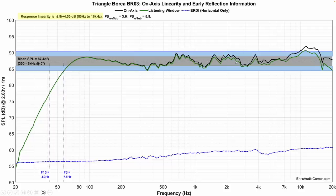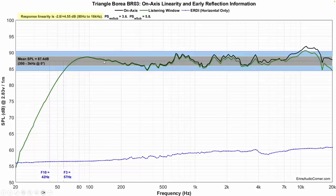Going higher in frequency, there's another dip at around 3 kilohertz, a strong spike at around 4 kilohertz, and then a rising on-axis response above about 7 kilohertz. This response, while mostly within a plus or minus 3 dB range, is pretty much all over the place and very inconsistent. You've got a dip followed by a peak, followed by another dip, followed by a series of peaks, followed by a dip, followed by a strong resonant peak, followed by a dip, and then a boosted top end. That's a recipe for disaster if you're looking for neutrality.